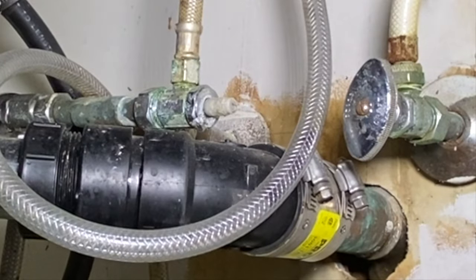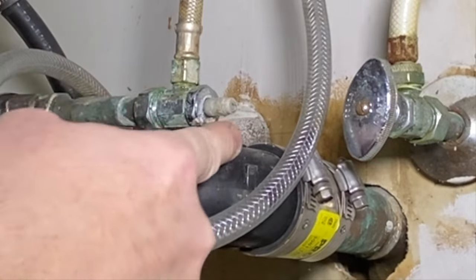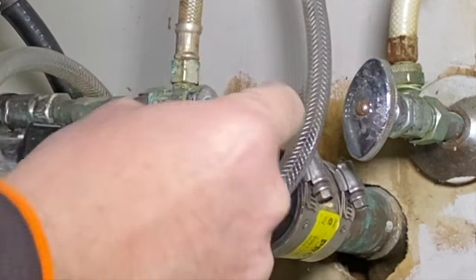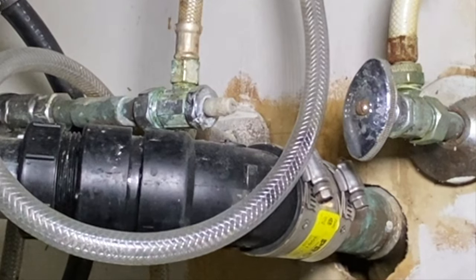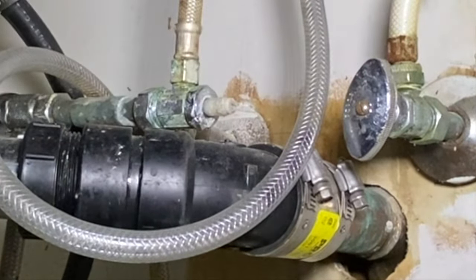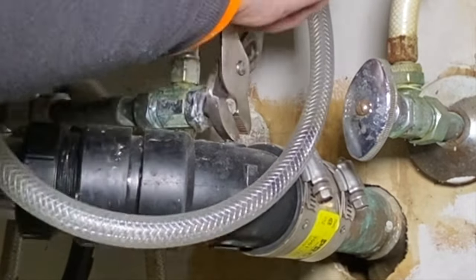So this is another thing we're going to have to deal with — you see this valve, look at where it is right on this drain line. You couldn't put one of these knobs on here if you wanted to. That's why it's all marred up — people have been taking channel locks to it and tightening it down. The packing nut there is also a little bit loose. We'll give that packing just a little bit of a snug, then take our channel locks and we're just going to have to get in here and turn this off.